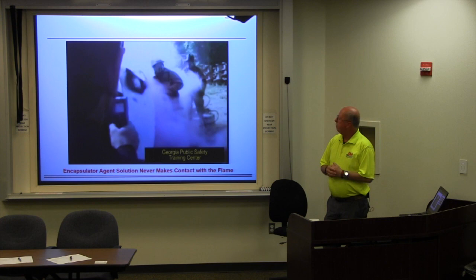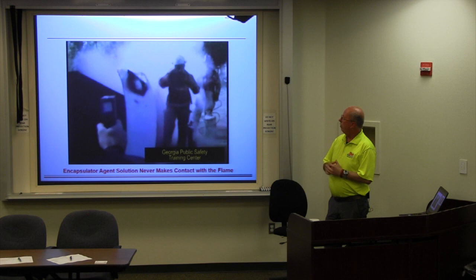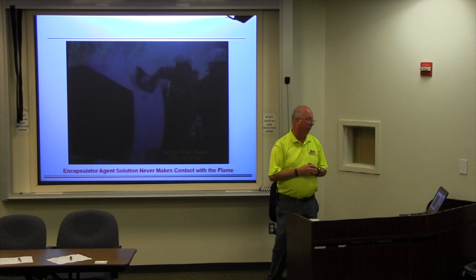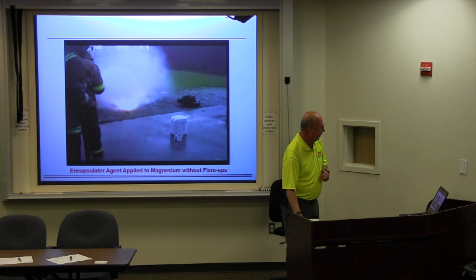Because F-500 is able to rapidly cool, he's now going to pull off his glove. He's going to put his hand on the bare metal, both sides. We've taken the heat, we've reduced it that much, that quickly. So with that being said, you eliminate the heat, eliminate the fire.